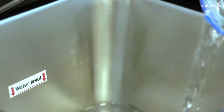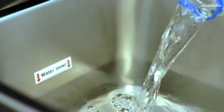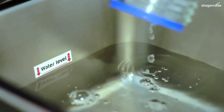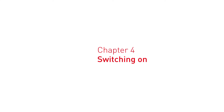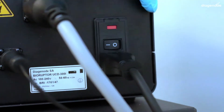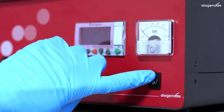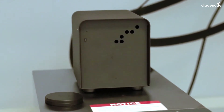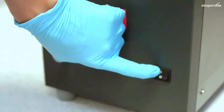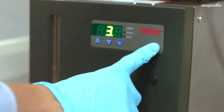Now fill the sanitation bath up to the red fill line with 700 ml of distilled water. For more details about water type, please check the good practices video. Now turn on the control unit on both sides and wait until you can see the digital timer lighting. When you turn the controller on, you will hear a click from the valve indicating that it is working properly. Turn on the water cooler by switching on the black button and then push the power button at the front to start the pump.